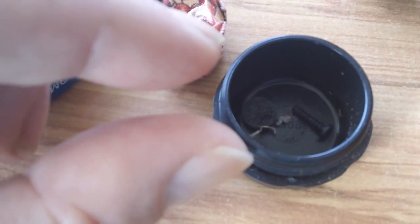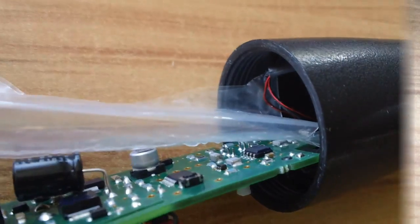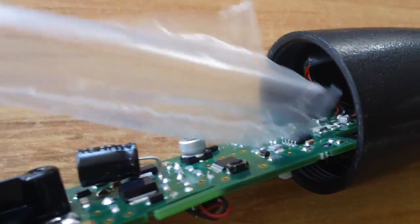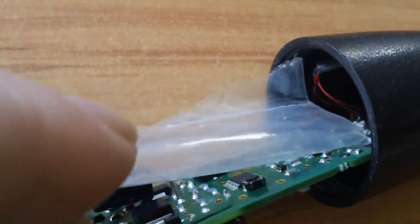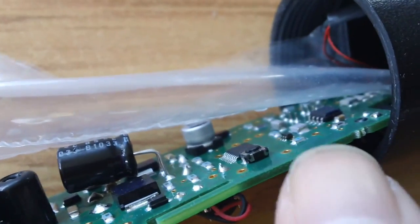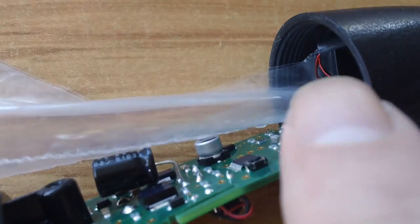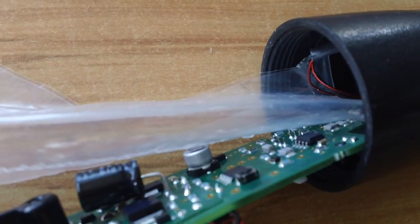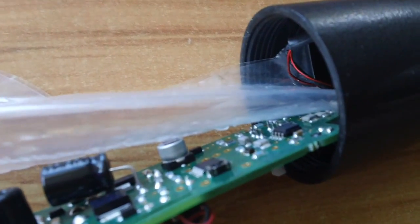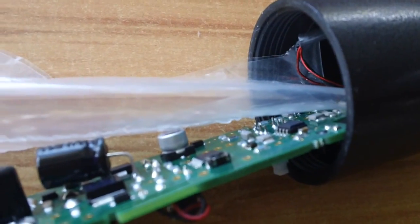My one's actually, after a year and a half, quite flat, quite compressed. Anyway, let's get it going and see what we can do. It's about crude, I'm just getting this little piece of plastic and putting it on top of the board, laying it under here, so these little red painted shellac wires won't touch the components on the board, which in my case seems to be causing it to sound off. I did notice there are little scratches and breaks in that shellac, so that's probably what's touching it. And of course, over time, general vibration might just scratch the shellac off.